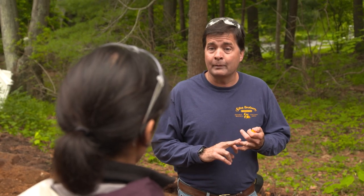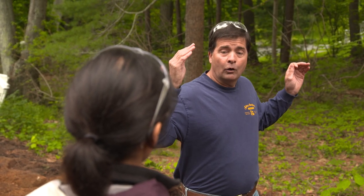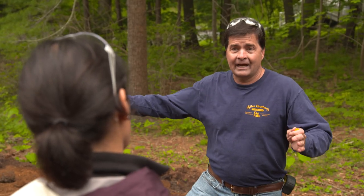We didn't drill and blast for one main reason. We'd have to get all the houses within 250 feet have a pre-blast survey done, and that entails a company coming in and documenting any crack on your foundation you might have, crack on your plaster, something off of the door, a cabinet might be out of line. They have to really record all of that, write a report with pictures. That sounds completely overwhelming. It does, and in the amount of ledge that we're taking out of here, using an excavator with a hammer on it really will get the job done.